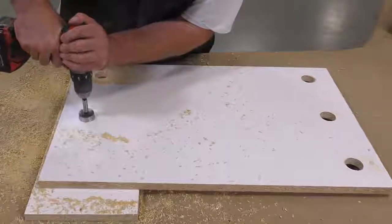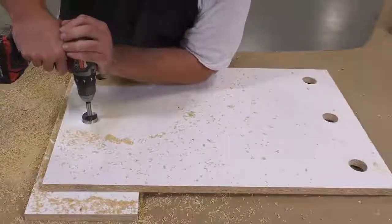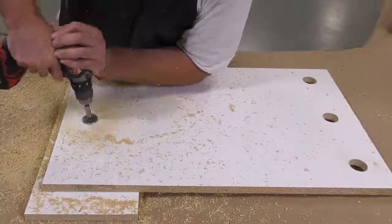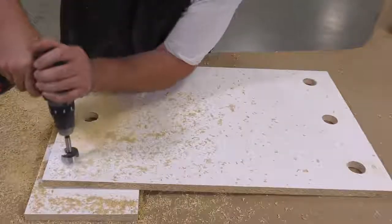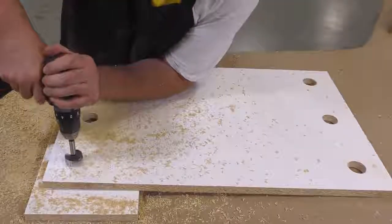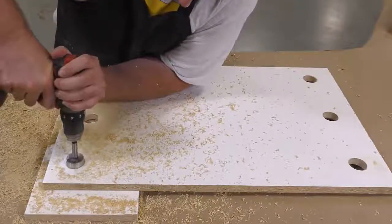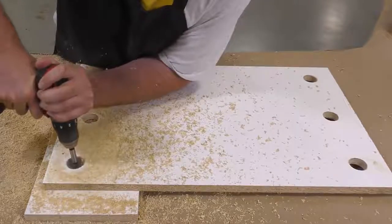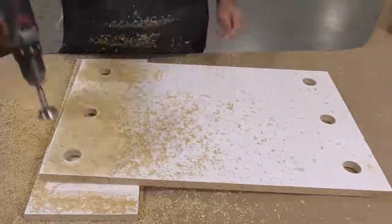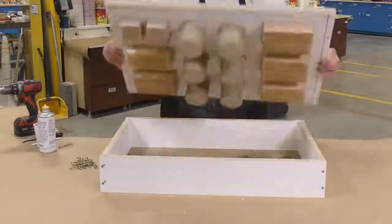Now, the way to achieve a good back pressure from a back pressure plate is to have the vent holes on the pressure plate located very conveniently in the right size so that the foam can expand fully, give enough pressure to the front, the face of our casting, yet won't build up too much pressure inside the mold box where the mold box itself could actually distort or break.